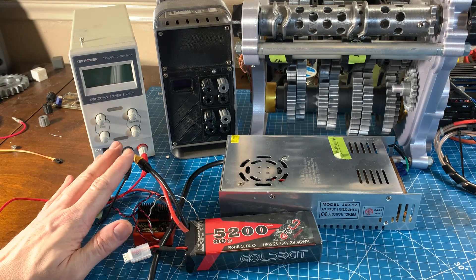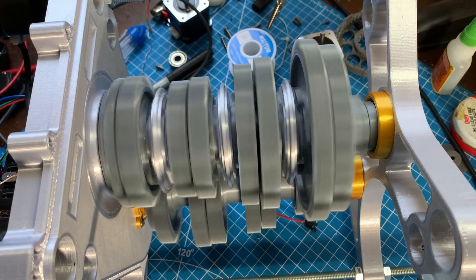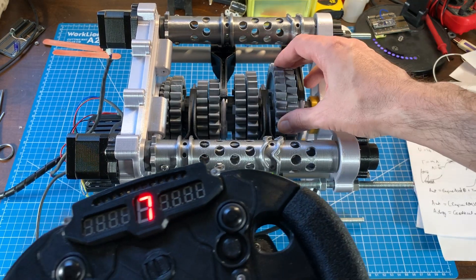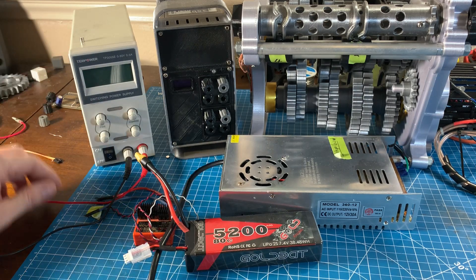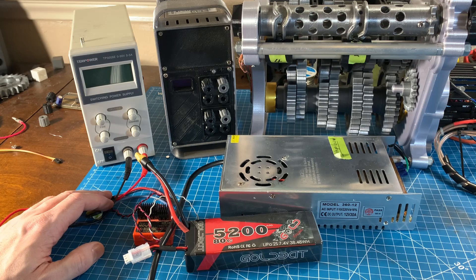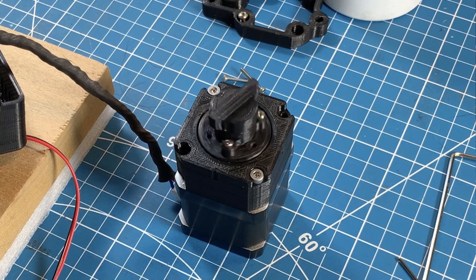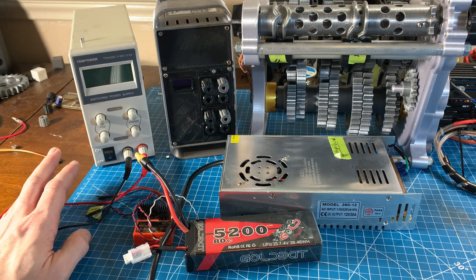Now onto a challenge I've had since the beginning of the gearbox: I've always had difficulty tuning the PID to control the motor speed without oscillation. I also had difficulty getting the shifts to work while the gearbox was spinning — the steppers would act like they had insufficient power and the sliders would get hung up. When I started working on rev-matching shifts and the vehicle simulation, these issues got much worse. My benchtop power supply was dropping out and supplying insufficient voltage. I then built another benchtop supply from an old PC, but that didn't help. I thought the steppers were being overloaded, so I designed and installed four-to-one planetary gearboxes, which did help quite a bit and gave the shifts more power, but the supply voltage was still drooping.